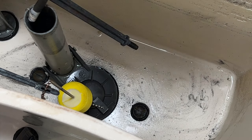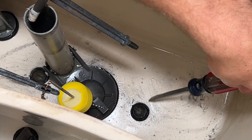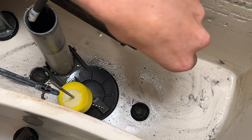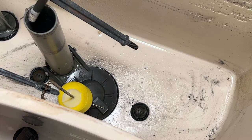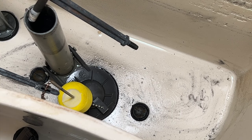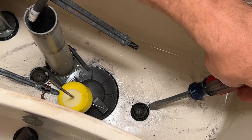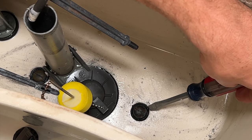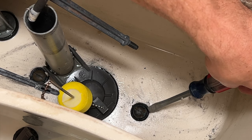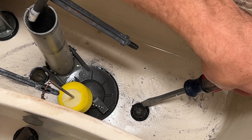Now with the water removed, you can see there is a mounting bolt here and one over here — this tank has two mounting bolts, and sometimes you'll see a third on the back side. Those mounting bolts are critical for a good seal and holding the tank onto the bowl, but are also the most common source of leaks. Then you have a black gasket, and that is critical — it needs to be in good shape and compressed so it's a watertight surface.